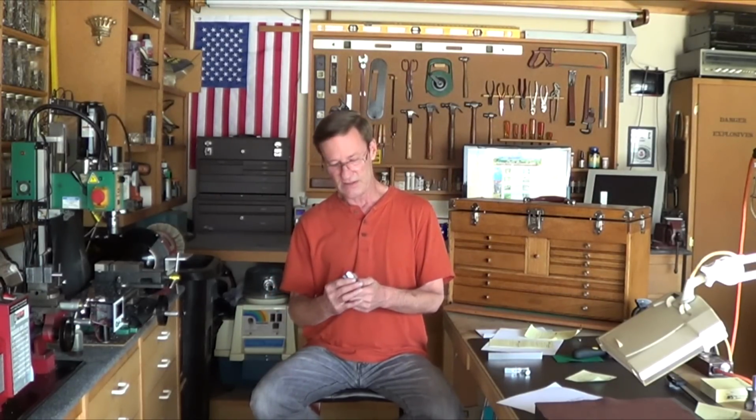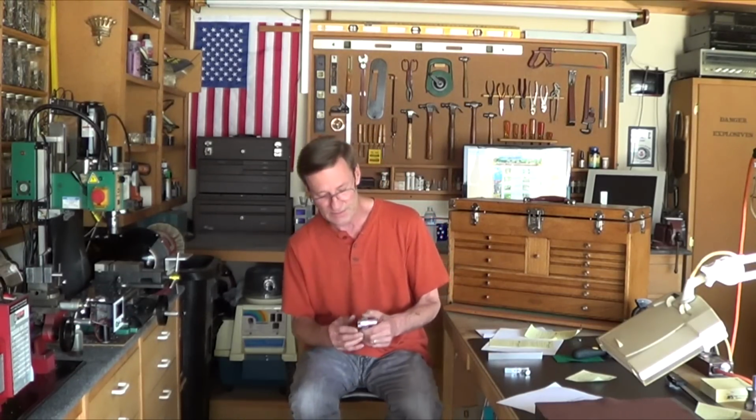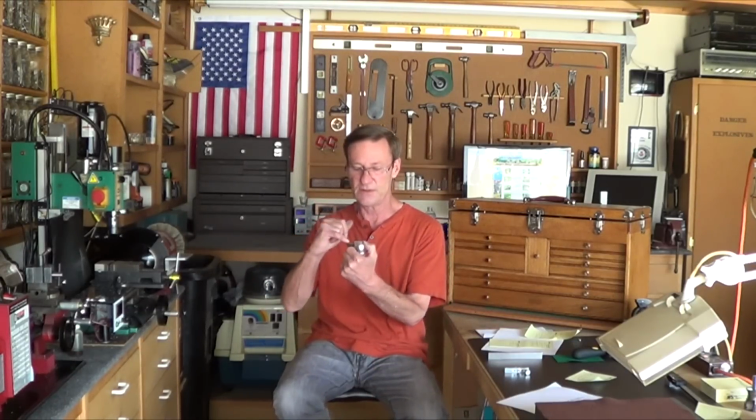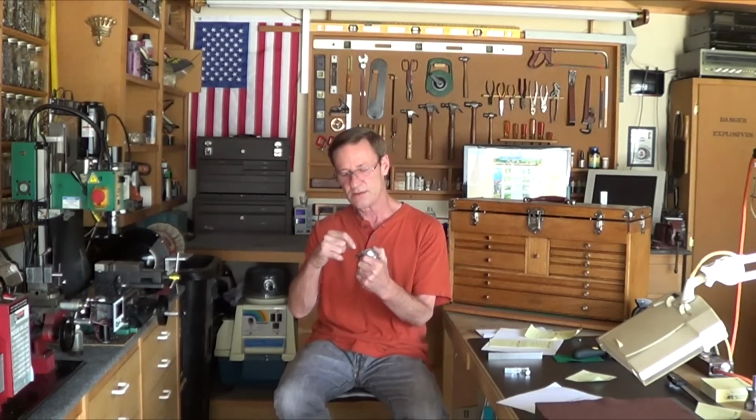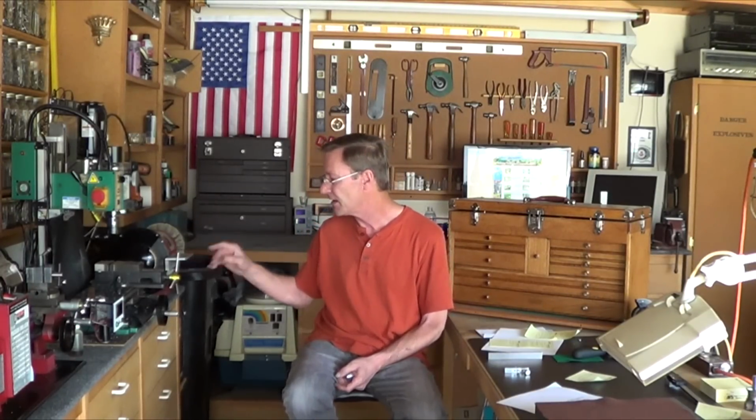And gave this guy a test run. It's just gorgeous. But in doing this, I kept thinking something was off, like a thousandth in. So I did a lot of research playing with the edge finder, because you have to find this face to come out and do this hole right. The edge finder, putting it in here and repeating it and having a dial indicator on the table, the edge finder is within a half a thou every single time.